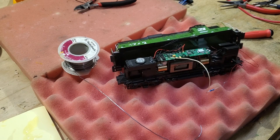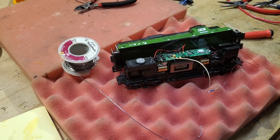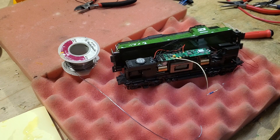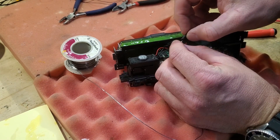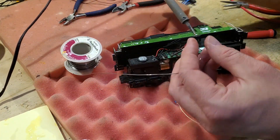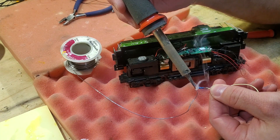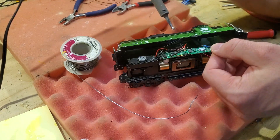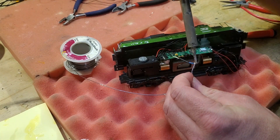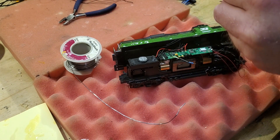So what I finally found out on this deal is that we need to use an output marked plus 14 here on the rear of the decoder. And what I've done is temporarily soldered in a 1000 ohm quarter watt resistor. And that works fine. So I'm going to tidy this up and put it back together. I'm going to preplace a hunk of heat shrink here and then tin this wire and make this all nice and tidy. So then what we'll do here is also similarly tin the LED — excuse me, we'll tin the resistor. And then we'll disconnect this other side and make this nice and neat as well. While we're at it, we'll retin that connection and then tidy this wire up.